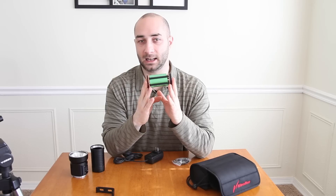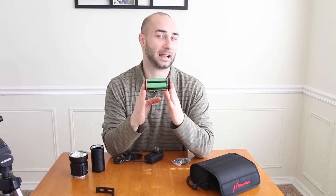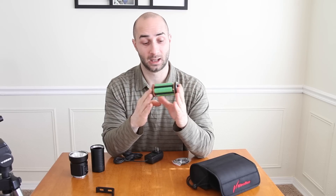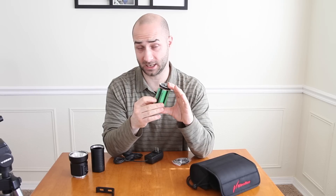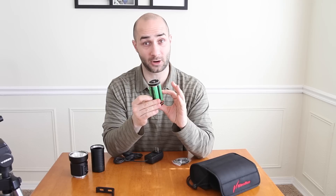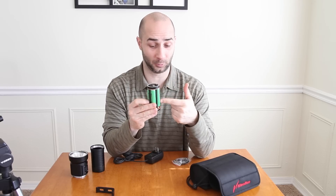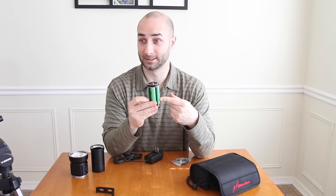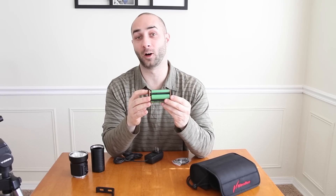However, in an integrated charging system, that means this pack is going to be charged to 16.8 volts. If three cells are put in at 3.7 volts each, and one is put in at 4 volts, and you charge it to the full 16.8 volts, that one cell could be getting charged to 4.5 volts. It's not great.